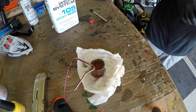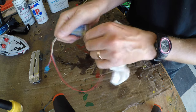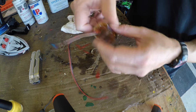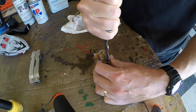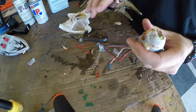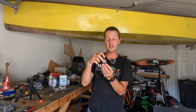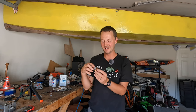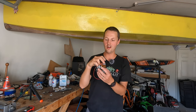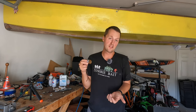The epoxy is all set up. I can try to peel off what's left of the container — I should have kept the time-lapse going so we could see it deform like that. It got a little hot, apparently. I may have mixed the epoxy just a little too hot, as the plastic of the container seems to have fused to it. On the upside, we're definitely waterproof — you could put this on a submarine, go to whatever depth you want, and it'd be fine. The downside is the servo board is now quite large and heavy, and of course you have to buy the epoxy and it takes time to set up — but it's a viable option.